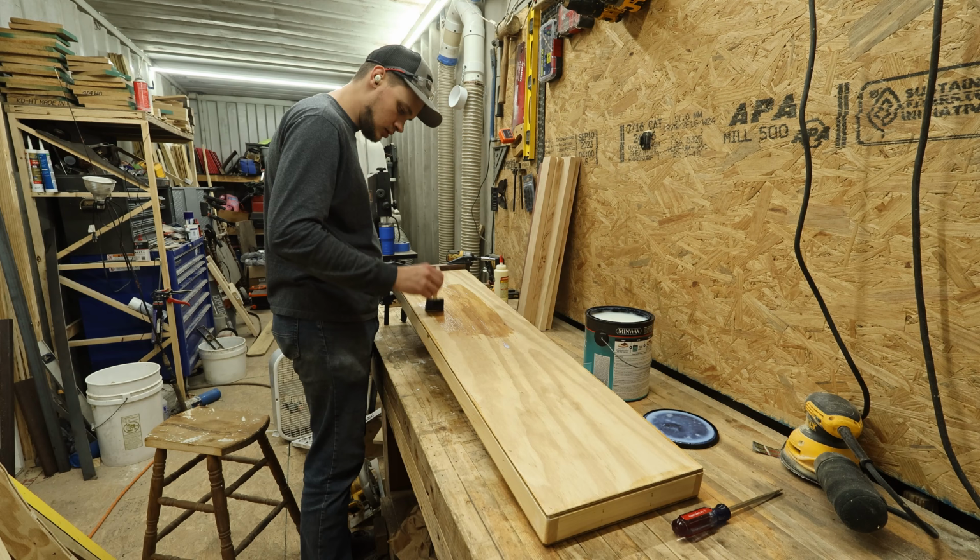So for those of you who don't know Torsion Box, I'm going to put up a graphic right here on the screen to show you exactly what it looks like. It's just a lattice work of interior supports between two skins. I actually have a piece of it right here. It's just a 1x6 pine from the local hardware store. That's all the webbing is.